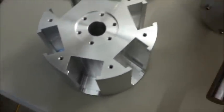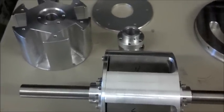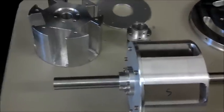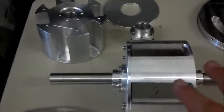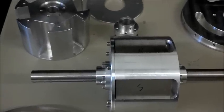You can see exactly where the keyway is on this side — we're going to use that on this side. One side sticks out a little bit further than the other; this side is merely to provide the bearing support and timing. With this kit we also provide three sets of coils — 18 gauge wire, 24 strands per coil set.